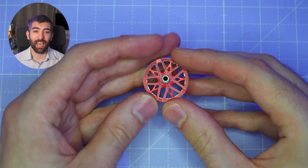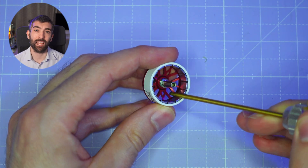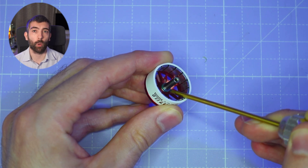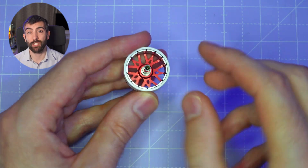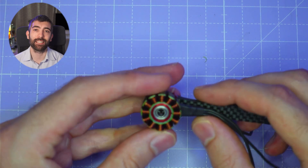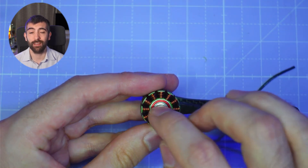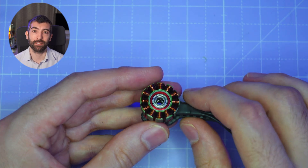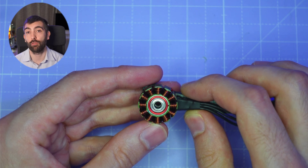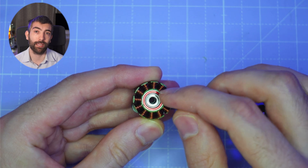Once the motor is apart, we can see inside the rotor there is some balancing mud at the top, so this motor has been dynamically balanced. There's also a little metal washer and an o-ring on the shaft — that o-ring cushions the top bearing in a sharp crash, helping it run smoother for longer. This o-ring has become pretty standard on all good quality motors nowadays. The stator uses an aluminium base with two 9mm bearings and silicon steel laminations. Importantly, this motor uses single-strand windings, which give much better cooling performance than multi-strand windings — great for high-performance high-kV applications.